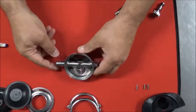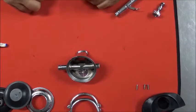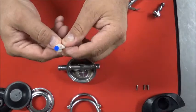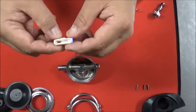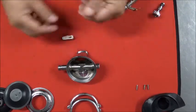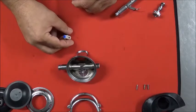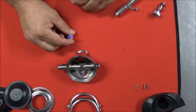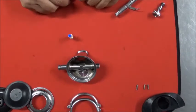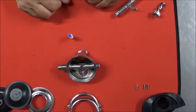So I'm going to set this down, and we're going to talk just a little bit about the Dural Poppet and how to put it into place. The Dural Poppet, which I talked about in the Poppet video, is in my opinion the best option to use in your 109. You can go ahead and use a balance adjustable poppet, works fine, but the Dural Poppet is a lot cheaper and readily available, has a replaceable seat, and it works fantastic in this regulator, and that was what they went to after they decided that the eraser head wasn't going to work anymore.